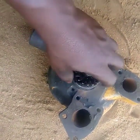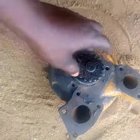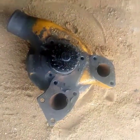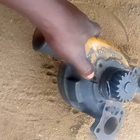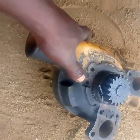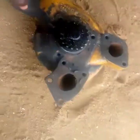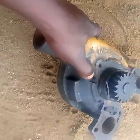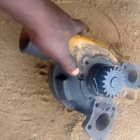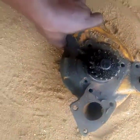You will observe that your oil level will be rising above the normal mark on your dipstick gauge, because another liquid is being added to it. But if you don't block the weep hole, the water will drain downward and at your own time you can work on it. You change the mechanical seal — it is certain that the mechanical seal is faulty, which is why the water is dripping.